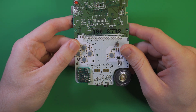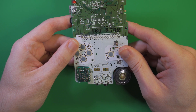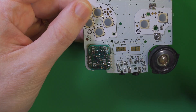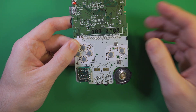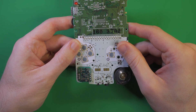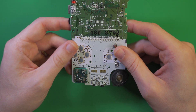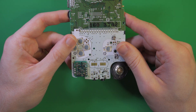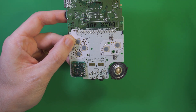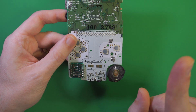So what's wrong with it? To be perfectly honest, not much. Unless your stock regulator is dead, kaput, gonzo, or you want to use a battery setup that exceeds the voltage range it's designed to accommodate — using a LiPo, for example, a lithium polymer battery — it should work perfectly fine in most cases, even with fancy backlit screens that everyone loves adding to their Game Boy Colors these days. But if you need a replacement...